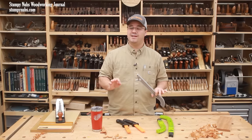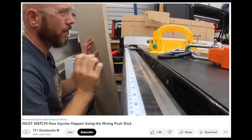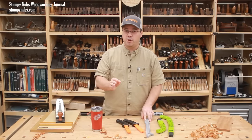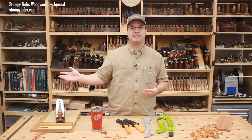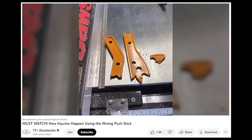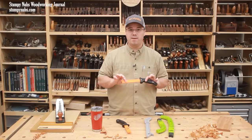Some plastics react well and some not so much. In the 731 video, he tries to show how plastic sticks can shatter by using a makeshift testing device while hiding behind some plywood to shield himself from potential shrapnel. Interestingly, he wasn't able to achieve any explosions or catastrophic shattering. That's because many push sticks — particularly those made by reputable companies who specialize in woodworking products — are made from carefully selected plastics that are shatter resistant. While other companies that just push out cheap plastic of all types with no knowledge of woodworking use whatever type of plastic allows them to sell their push-stick-shaped object for as little as possible. Unfortunately, many retailers don't specify the type of plastic they use, and very few table saw accessories have any markings on them that would identify the type of plastic.